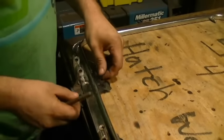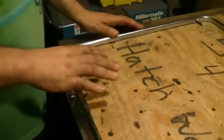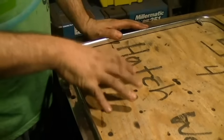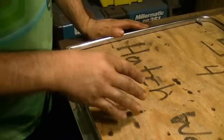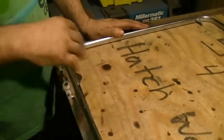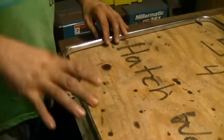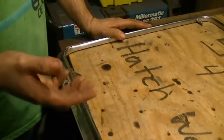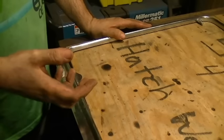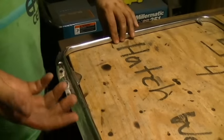I just took my spacer out and peeled off the tape. I went ahead and went a little above and beyond what the manufacturer had done. When you see a product like this hatch — probably thousands made — somewhere there was a jig used to align everything, do all the welding, and drill all the holes. That's a manufacturing process. When you're by yourself in your shop, you're not a manufacturer. So putting three plug welds on a hinge doesn't sound like a lot, but if you have to keep everything straight the way it was in the factory, you could spend 90% of your time setting up to weld — sometimes 95 to 99% — because running the weld bead is easy once you get the hang of welding.